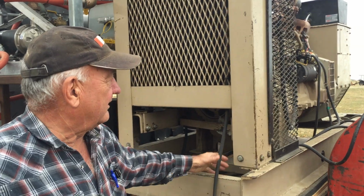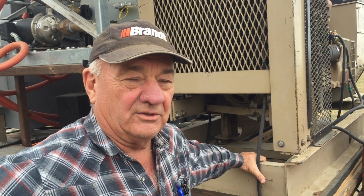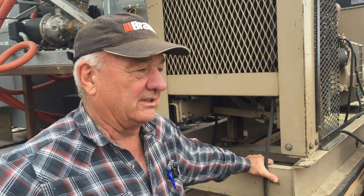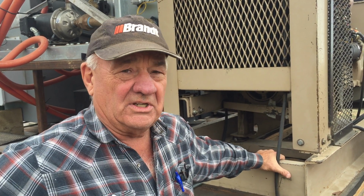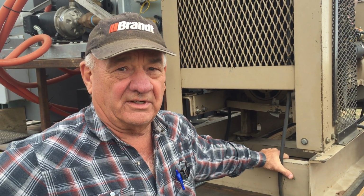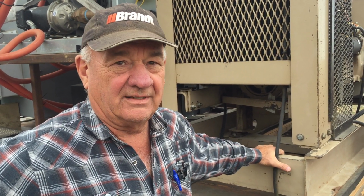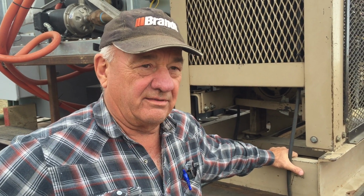Yeah, this came off the oil field, but it's a 100 kilowatt unit, got its own motor and everything, and we put this on here instead of a PTO so that we could drive it around with a truck or something. But we will have a PTO on most of these from here on in, but it creates all the power for the induction unit. And a PTO generator, of course, would be much smaller without the full motor. Yeah, it's about a third of this size.